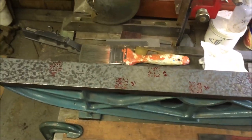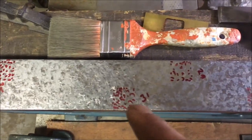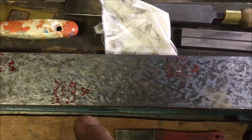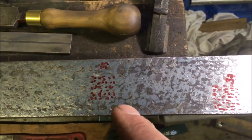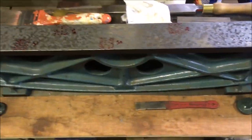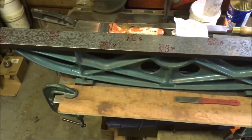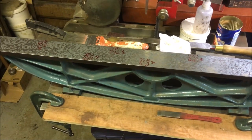Oh, we'll give it another three cycles. And I've just sampled it, and we're down to 30, 35, 31. That's the lowest sample, 29, 30, 30. 33, 37. Distribution's not bad. There's a good 50% coverage on about 85% of the whole surface. That one spot's got some larger holes. I've put an extremely light coat of ink to get the print, so I can pick out the actual points of contact. So I am going to call that done. Hurrah!